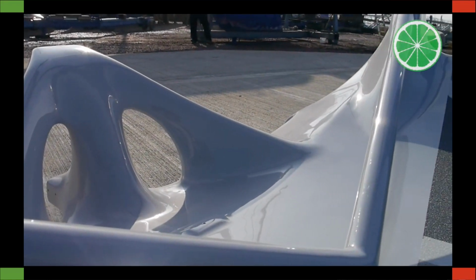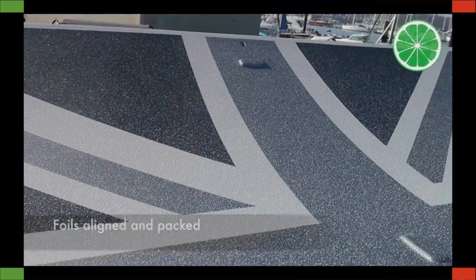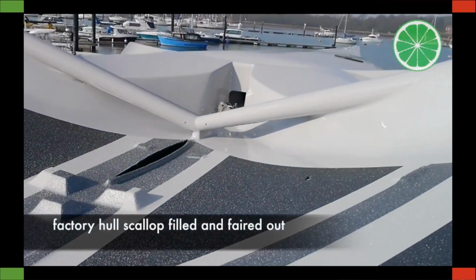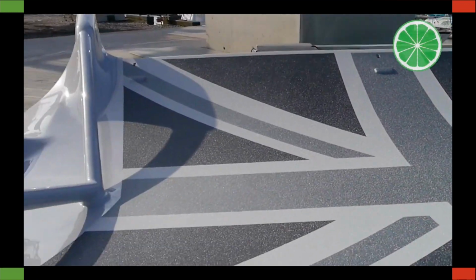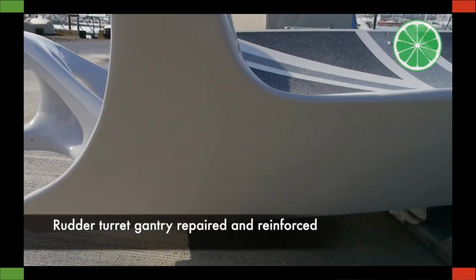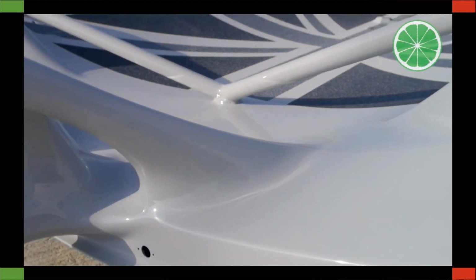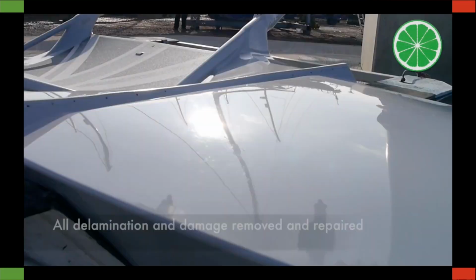Smaller items, dinghy sized and components, I tended to use a 1.2 gravity gun. I was a bit like you, I tended to thin it quite a lot to get a better finish and reduce the rubbing. But sometimes if you were just coating something to cover it, you'd just roll it on. I know it's not entirely meant to be a roll-on product, but you could just build the coats up and sand it back. I don't know whether you agree with this.